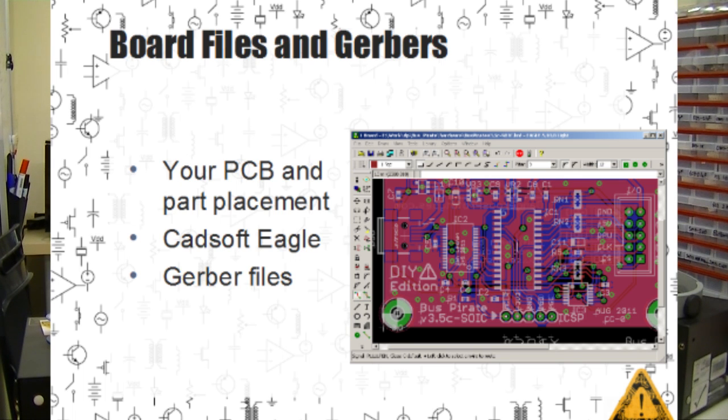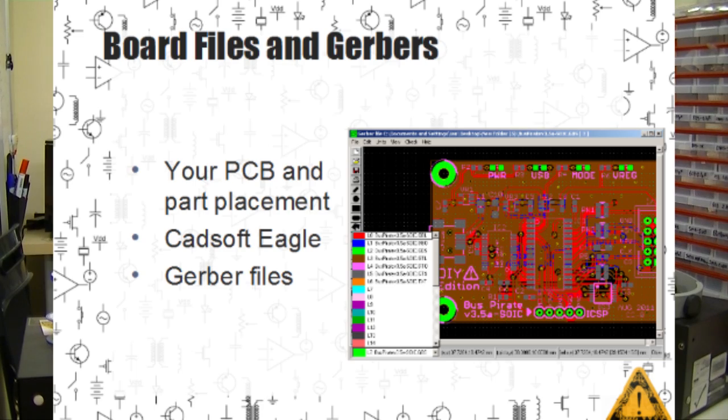We use CADsoft Eagle for our boards. It's free but not open source. However, a huge chunk of the open hardware community uses it, so you find a ton of footprints and a ton of existing projects already in Eagle. Gerber files are a standard format that any circuit board manufacturer can use to build circuit boards. Just about anywhere in the world, if you find a board manufacturer, you can send them Gerbers and they can return you a PCB. If CADsoft Eagle files are like a Word document where you can still change things, then Gerber files are like a PDF where things are static, but they look the same wherever they're displayed.